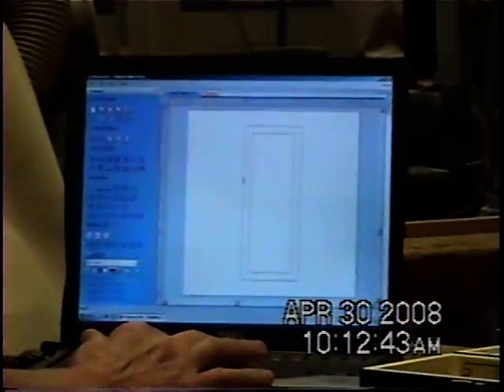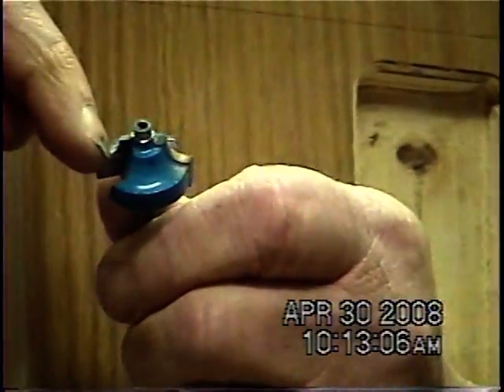This right here represents this hole with this rounded piece cut onto it. It's very simple on the computer and very simple to draw. What I had to do was make the offset between this line and this line a quarter of an inch, in order to use this bit and get it to come out in the right spot. The bottom bar across the bottom is a half an inch, and I didn't want to start right on the center of the bit — I wanted to offset it a quarter of an inch so it starts over onto this part of the cut.